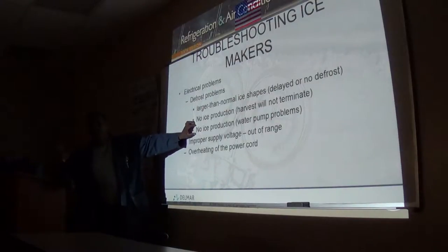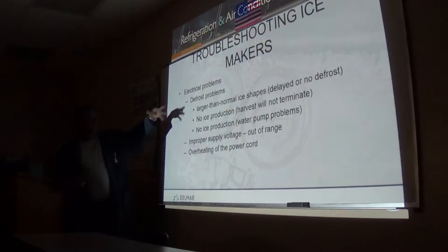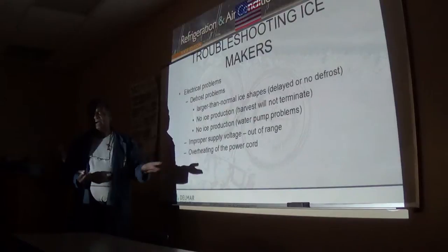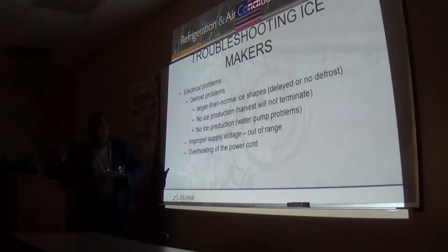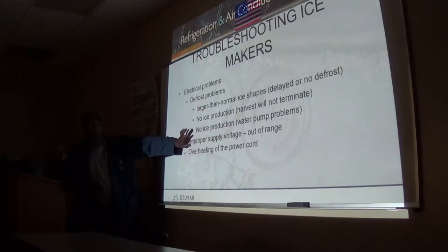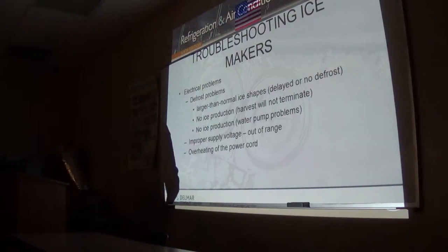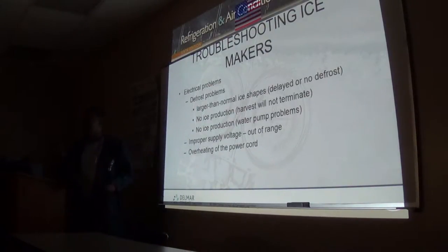If you can see water coming across your evaporator coil, at least we know, okay, it switches on in ice making position. You will check to see if we have water in the sump. If we do have water in the reservoir, check if the pump is running. If it isn't, check to see if you're getting power to the pump. These pumps have a little plug on the side; you just pull the plug and check for power there. It should have power in the ice making mode.